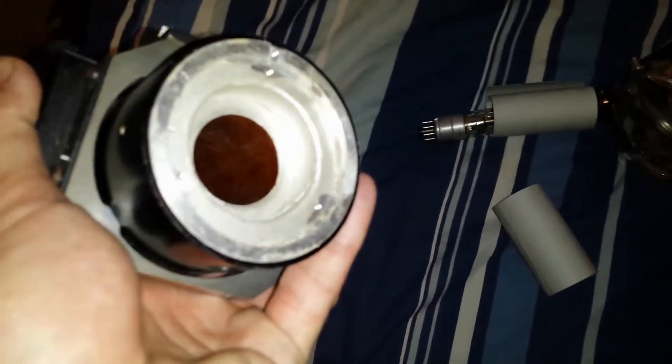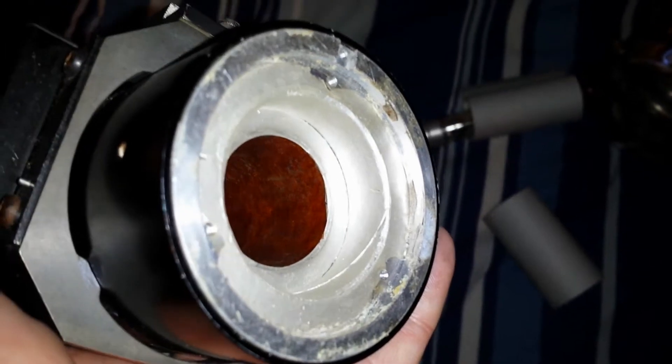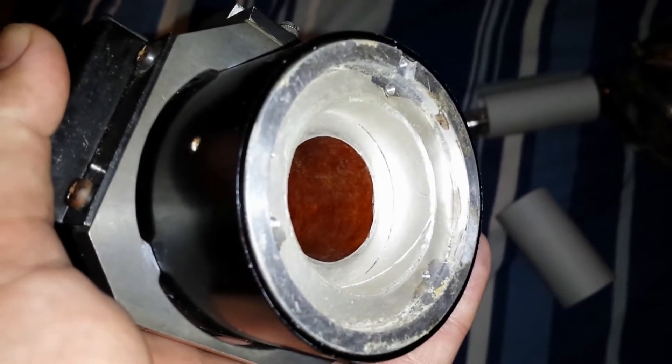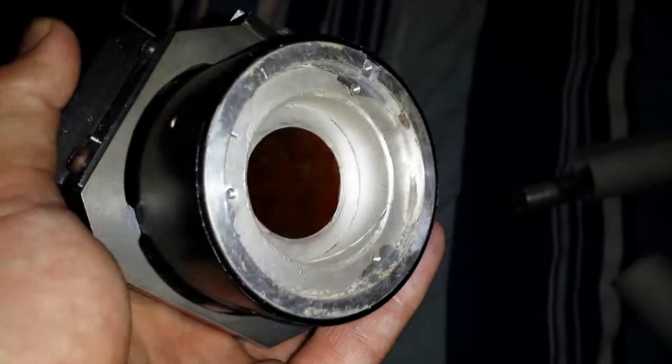Anyway, if this works I should get a trapezoidal-looking black-and-white picture when I put it all together. Another problem is that the tube is not going to go right down in, because as you can see there is still a bit of extra metal before the edge — so I can't have the deflection running right from the top to the bottom of the tube neck.